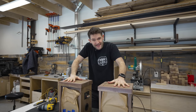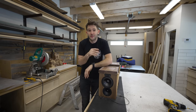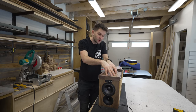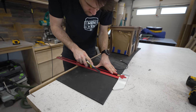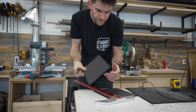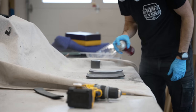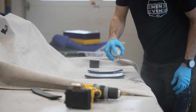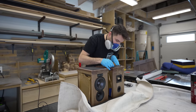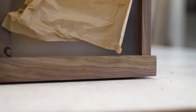Now we are ready to integrate the last space-saving feature into these speakers. Earlier in the build, you may have noticed that I cut these recessed areas in the bottom of the speaker cabinets. We are going to cut some small sections of foam mat and place it into the recessed area. One of the secrets to getting the best possible sound quality is separating your speakers from whatever surface they're resting on through some sort of isolation layer. My old speakers sat on thick foam blocks, which worked well but were ultimately pretty ugly and took up a lot of space. So just like on my wooden Xbox build, I used Super 77 spray adhesive to attach the foam — simply spray on a nice thick coat, give it a few seconds to tack up, and press it in place. Now we have some nice, clean isolation pads that you can barely even tell are there, except for this telltale little shadow line all the way around the base.